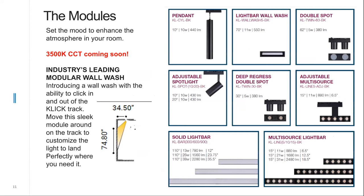In summary, the modules provide the form factors lighting designers need to create a layered appearance and cover all lighting applications for illuminating a space. You can set the mood and enhance the atmosphere by selecting the right fixture and pointing light where you need it. For wall wash optics, a 34.5-inch setback on a 10-foot wall will uniformly wash six feet of the wall in the middle. To make the primary distribution more intense, move the fixture closer to the wall, something closer to 18 to 24 inches.